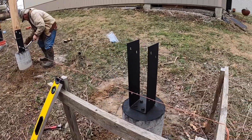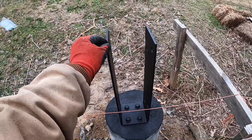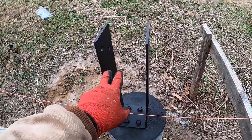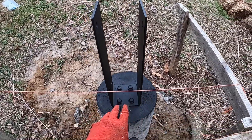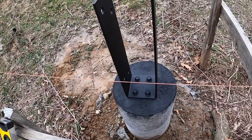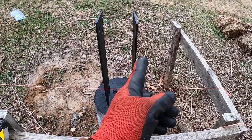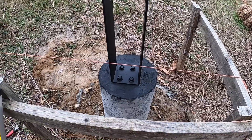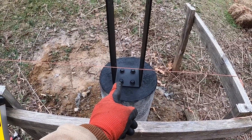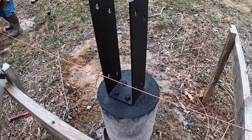For anybody just tuning in, the way I actually made these brackets — I just took five-inch by quarter-inch bar stock, sheared it off, then punched holes where I wanted them, and bent it on a brake. I had to finish bending it with the torch, just bent it in my hand with the torch. So I got them both 90 degrees — bent one 90 and then the other one not quite 90. Then I just anchored it into the pier where you could put rebar and wet-set it. This was just easier for me to get everything lined up at my slow pace.